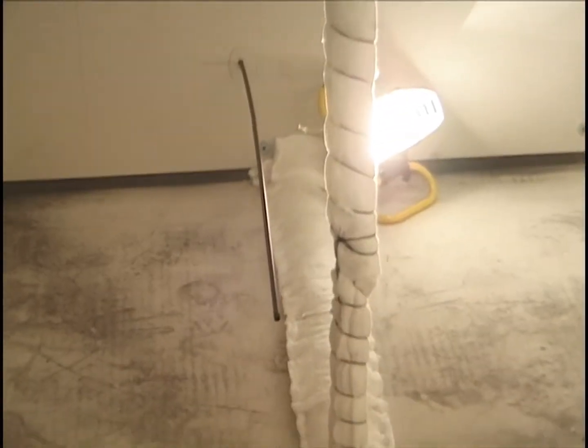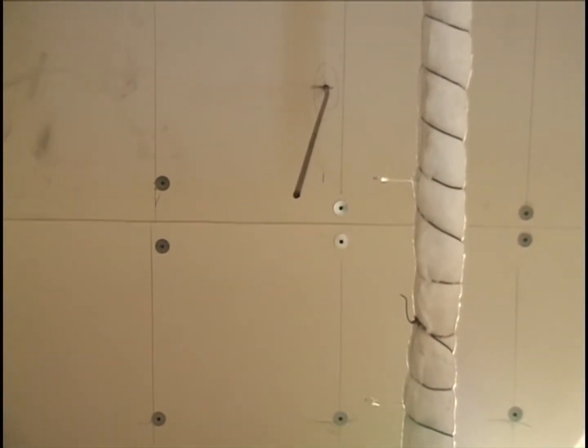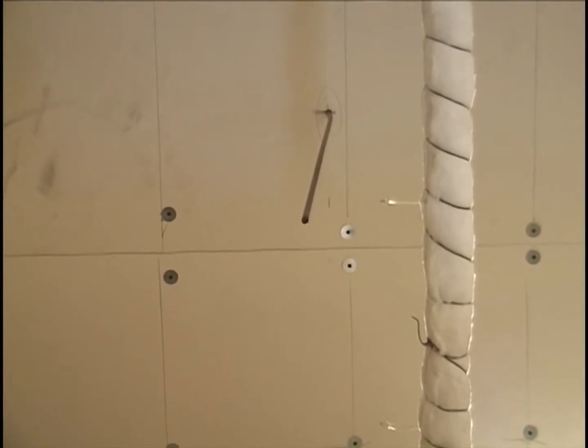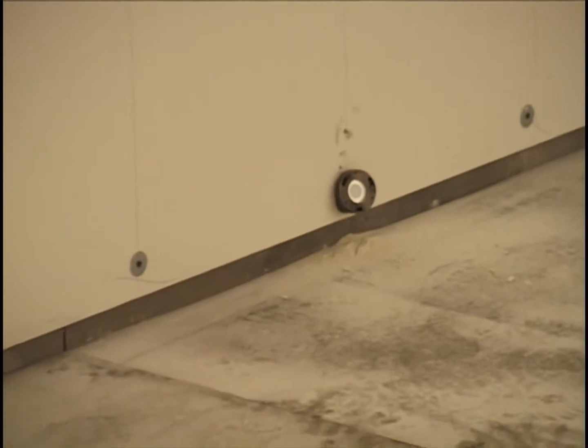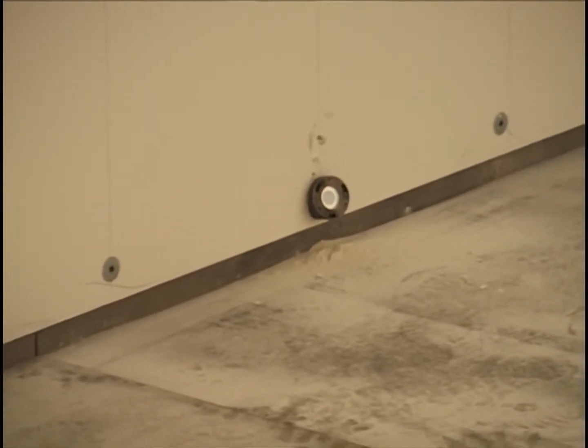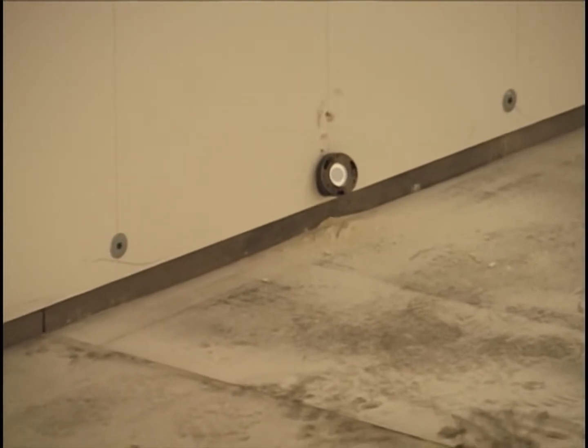These thermocouple trees have water cooling in the interior, a water cooling line. This is on right now. This is the thermocouple tree in the northeast corner, about 4 feet from each corner. And there is an aspirated thermocouple just to its left. And south of it, in the ceiling, there's another aspirated thermocouple. Right there is one of the camera views of the interior. That's in the east wall, looking generally northwest.